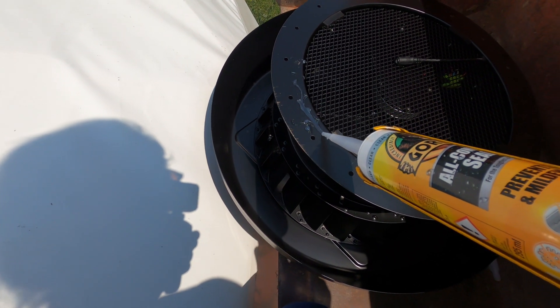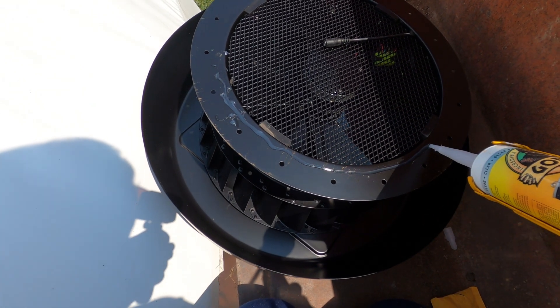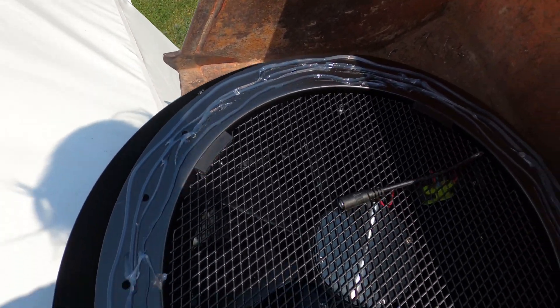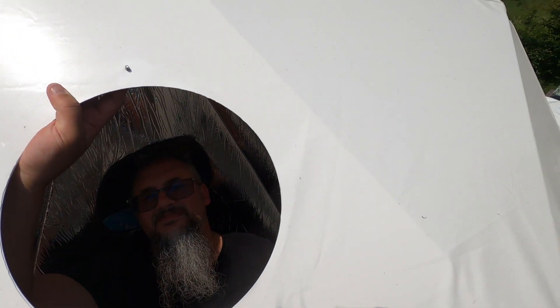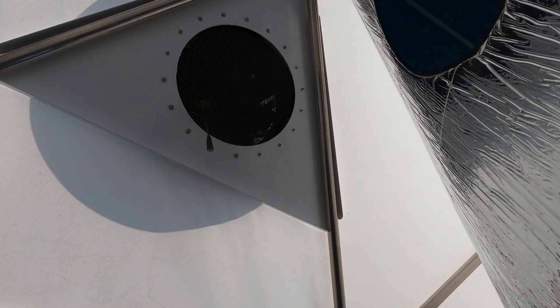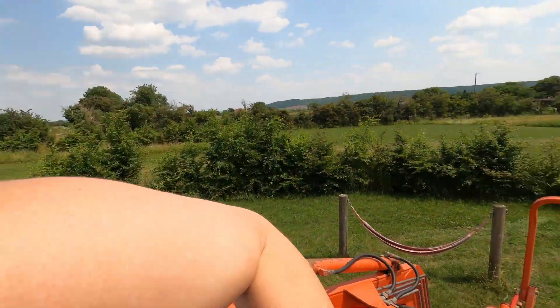You're just basically doing lines of silicone. The silicone is all on — I put quite a lot on — and now you have to work fast. I'm going to place this up and then try to get it onto the bolt that Brian's already put through. This is now hooked on to the first screw that he's put in, and now I'm going to put the washer and the nut on and do that all the way around. That is the solar vent now installed — all the screws are in. Here is the vent viewed from the inside, and now we just have to get the insulation back on. It took us about 45 minutes, so not too bad.